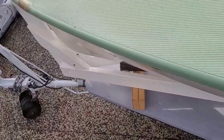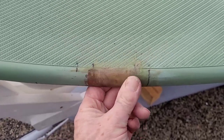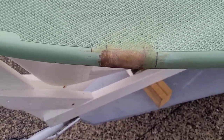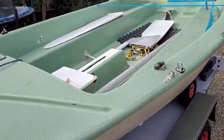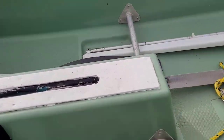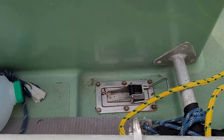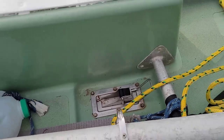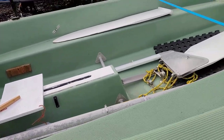I also need to make some more repairs here — this is the top-level repair where I accidentally hit the wharf in quite a high swell and it cracked up the side. You can see if we come down under here that I still need to repair the underside. We've also got a little bit of a leak, I think probably around where another modification has been made, which was the Venturi vent here. I need to do some patching around there because it does seem to get a bit of water inside between the two shells of fiberglass.